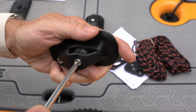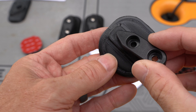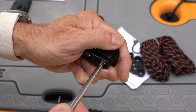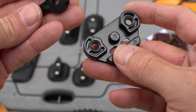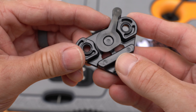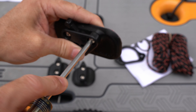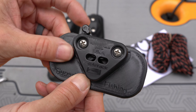I'm going to go ahead and do both of the pulley setups — that's the front and the rear — and I'll show you how to mount those on the boat. Next I'm going to put the pad hook onto the mounting adapters, and those are using the smaller screws, and there's two of those. Then the next thing we're going to do is build the lever lock assembly, putting the lever lock lever in place — the overlapping part is going to point out. That whole assembly is going to fit against the mounting plate and should look and function like this after you get it put together.